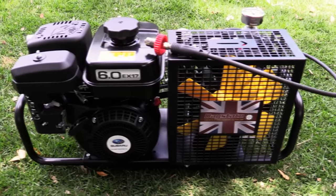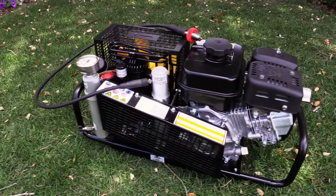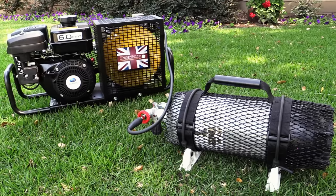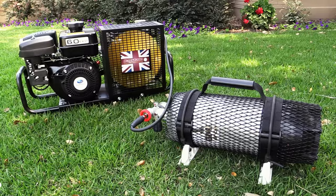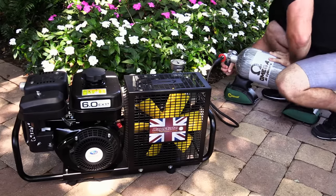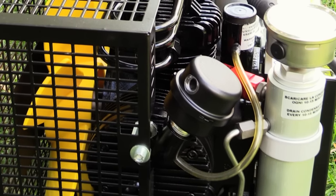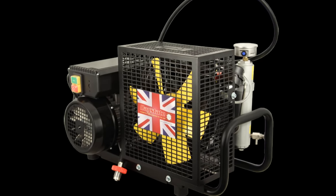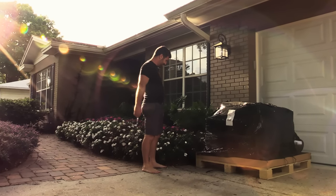If speed and the ultimate in commercial grade are your thing, then the Daystate 4,500 PSI compressor won't disappoint. At one-third throttle, it'll take a 100 cubic foot SCBA tank from 3,000 to 4,300 PSI in less than 8 minutes, and fill it from empty in 43 minutes flat. Its Subaru engine and Italian-made Coltri compressor can handle anything your shop or club can throw at it. And if simplicity is more important than portability, they can be had with an electric motor too. Less than $3,000 gets it to your door.